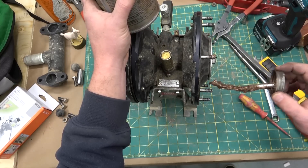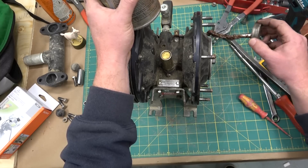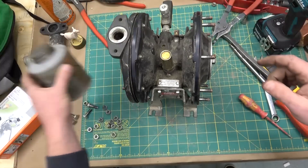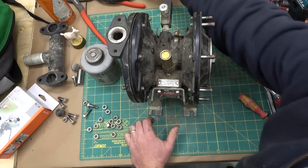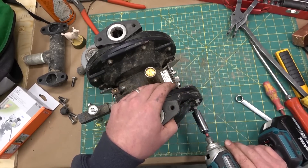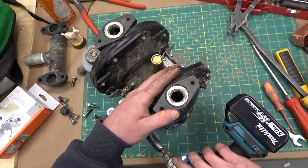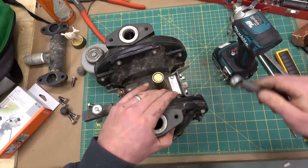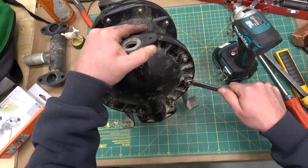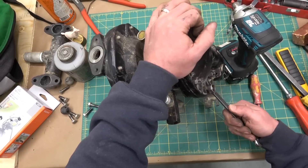Just a wee precaution: these are stainless bolts, and of course stainless — high nickel, high chromium — they love to come together and not come apart. So for the sake of a couple pennies worth of Never-Seez, just goop some on there and help the next guy out, because the next guy is going to be you. These nutted studs are crushing the elastomer — the nitrile diaphragm — so you need but one or two ugga-duggas and then come back. No need to go all 300-pound Dutch-boy apprentice on the thing. Come in with your proper torque wrench — click, snug. That's all you need. You don't want to ruin a $1,000 pump by being overzealous.